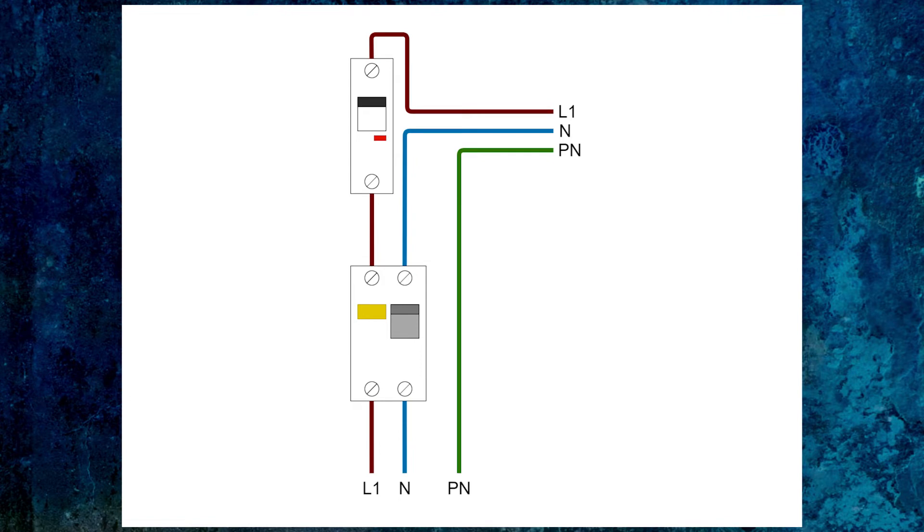So if it's one of these tripping then it's too much current. The next thing you'll want to know is what does an RCD do. It's a safety device meant for protecting humans and animals from electric shock. It is not meant for protecting the wires of the installation.